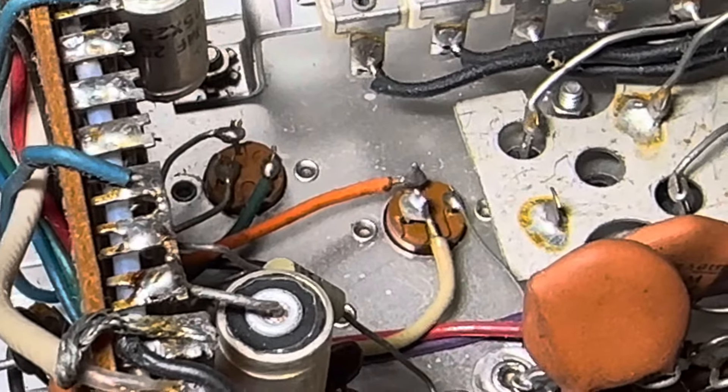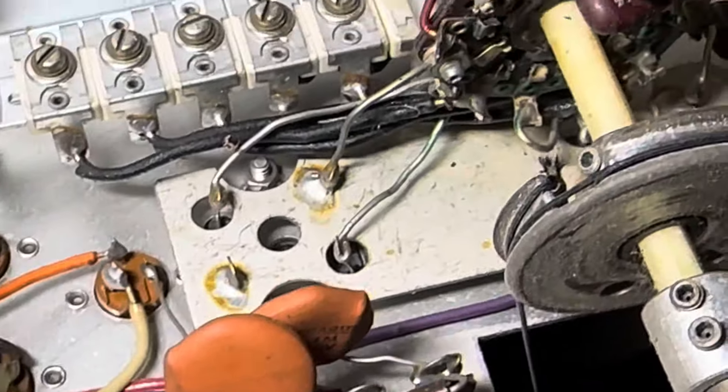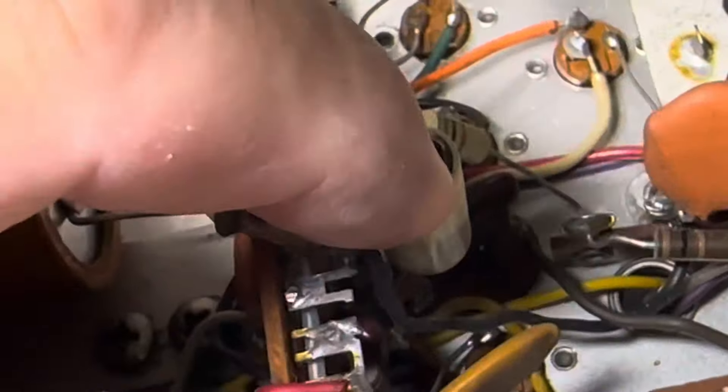As long as I don't break any wires or break any contacts, I guess I'll be all right. I did reseat some of the transistors. Every transistor in here is socketed — you can see those are transistor sockets. After reading the blogs, there's a bunch of 0.1 capacitors in here that go bad, so those are probably ones to replace.